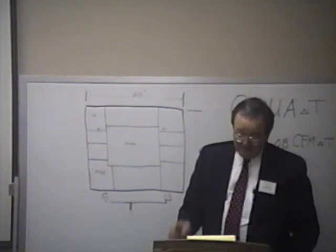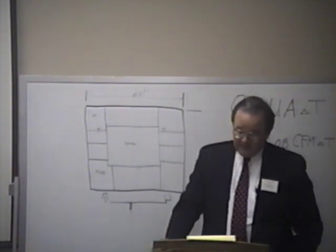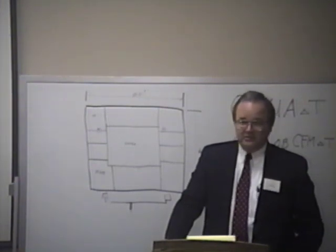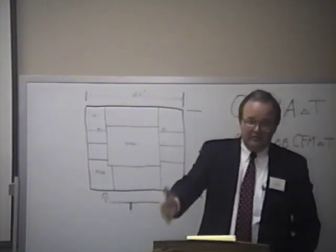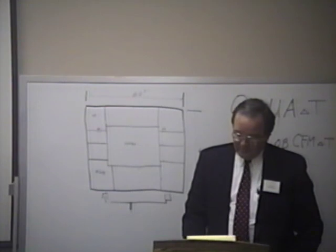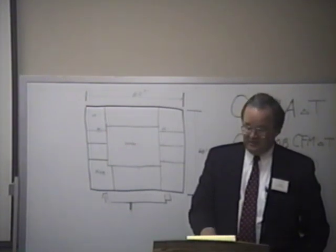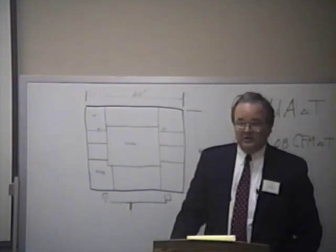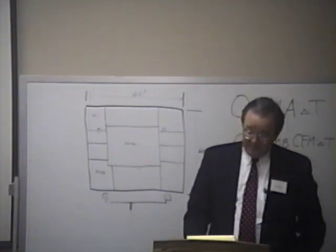Okay, reducing or eliminating vestibule heating. That's a way to save energy. Again, this might not be something you choose to do. You might like to have your vestibules warm. I know it's a comfort condition for a lot of buildings. Could be that you could build a vestibule and just not heat it, maybe that as an approach. This little picture here is depicting maybe an older building that has vestibule heating, where you'll frequently go into a building and the vestibule might be 85 degrees. Well, you could control that better maybe, or eliminate it.